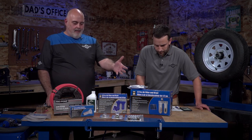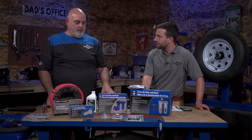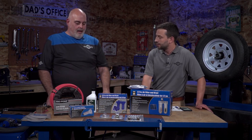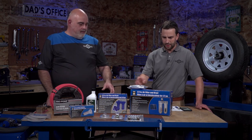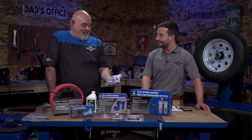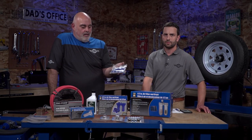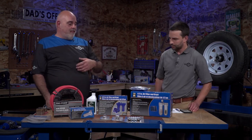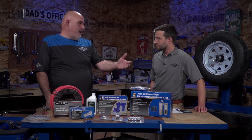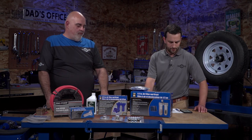We've got some filter dryers — desiccant activated. The desiccant inside these filter dryers is going to pull moisture out of the system. You don't want any moisture in your air tools or going through anything you might be spraying. I'm reading on the side: silica gel — that's familiar, like the little package you get with new shoes or in some toolboxes. It uses small pellets that change colour from dark royal blue to pale translucent pink once saturated. Once that turns pink, it needs to be changed — it's not trapping moisture anymore and water getting into the tool will mix with the oil and do a lot of damage.